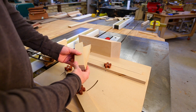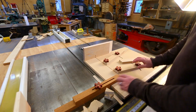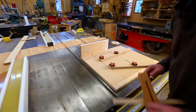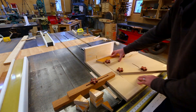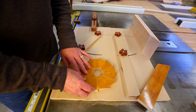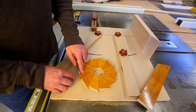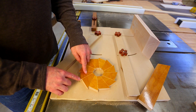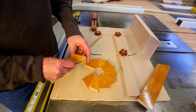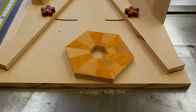It's the bit in the middle that's a little different. If I make a ring with the fences even to the blade I get a standard ring, but I can also cut a ring with the fences not even to the blade. When the fences are not symmetrical to the table saw blade, you get a sawtooth pattern — this corner and that corner don't line up between pieces. You get pairs of two different segments, but they still work as a ring.